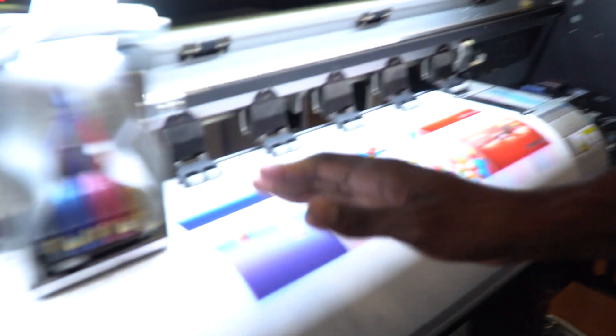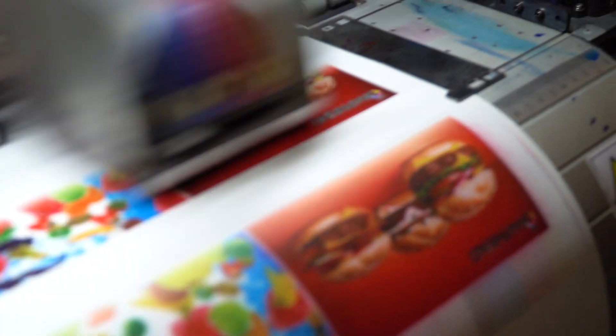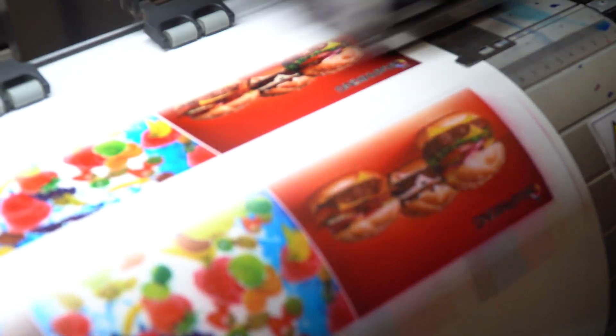We're now printing and I do not have any overspray. You can see the difference between the old blue and this blue — look at the edges: very crisp here, very blurry there. The same is visible on the magenta side — not crisp on the old print, perfectly clear on the new one. So ladies and gentlemen, that is how you fix overspray: check your dampers, your ink level, and of course the height of the head. The last potential issue would be the printer head itself having exceeded its lifespan — about 2,000 square meters for the XP600 head — though for heads like the i3200, DX5, DX7, and 4720, the lifespan is much longer. Thank you for watching; stay tuned for more videos.